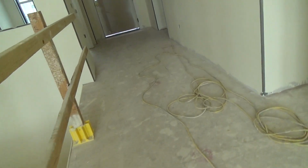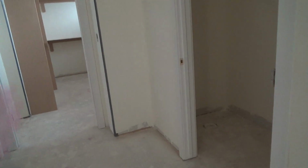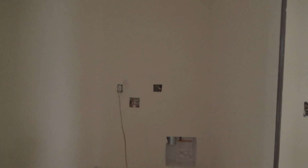Well, I'll give you one good reason. Like in your bathroom areas, where you have your bathrooms at, let's say. Okay, here they've got a bathroom area here. I would do the exterior walls of your bathroom, which are still on your interior of your house, let's say, just for a sound dampening for, you know, when they're flushing the toilet. If you just have an area here where the toilet is, maybe you decide, I don't want to do all my interior walls, but I want to soften the noise when somebody's in here flushing the toilet or something like that. Maybe you just install insulation on your interior walls for that. But this particular house, they decided they wanted all of the walls insulated, and it's for the sound dampening.